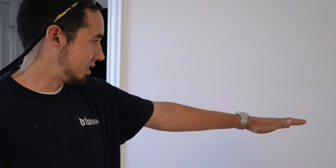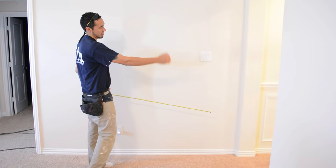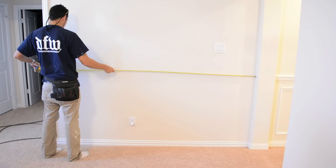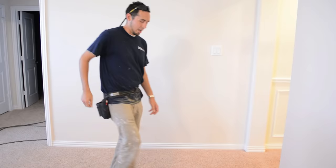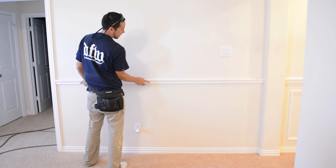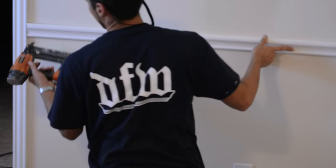My reference points are marked on the wall at 40 inches up. I'll take a measurement for my chair rail — it's going to dead end into that wall on one side and dead end into the door casing on the other. The measurement across is 93 and three quarters, and it was already cut. So I'll just line up my chair rail on those reference lines, shoot it in, and I should be good to go.